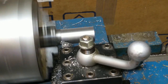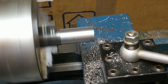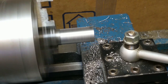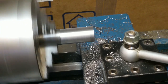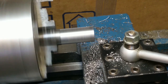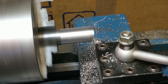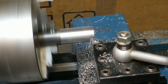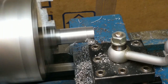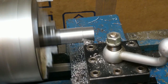So it'll be a little long for the threaded part I want to do. Okay, that was 50, so I'm going into 70. So I'm moving it in 20, and that'll give me another 40 thousandths depth of cut. And there it goes, automatic feeding again. So we'll keep doing this until I get the diameter down close to the 0.4375 I want to thread. And I'll come back then and show the interesting part where you're sneaking up on it and how that works. So, see you soon.